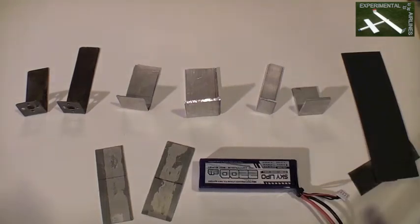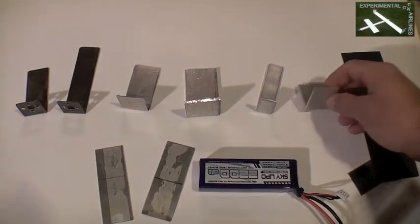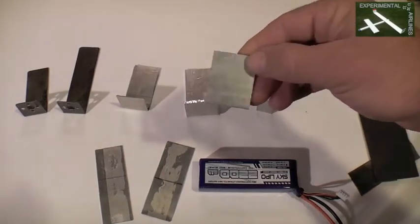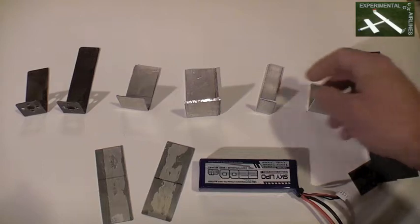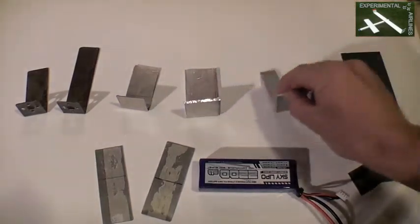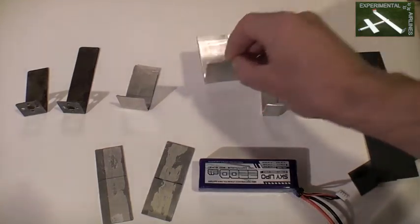Here are a few of the sources I've used with success for single-piece metal motor mounts. Here's a piece of angle aluminum that I've cut carefully with an ordinary miter saw with a wood blade and eye protection. You can also use a piece of bar stock aluminum bent into an L like this, although it gets a little heavy.